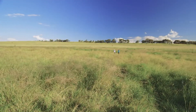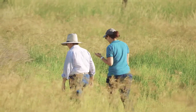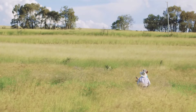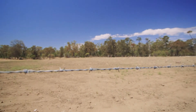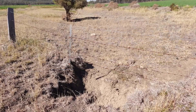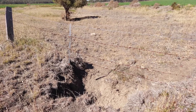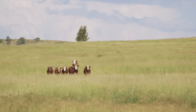This project is unique because it was really well done by Robyn using the battering technique. Robyn spent a lot of time monitoring the site — even after a rainfall event, when there were early signs of wash starting to happen, she went back in and repaired those areas. She followed the principles to the letter and put a lot of effort into the rehabilitation after the earthworks were done, which gave it really good ground cover and meant it's been really successful. One of the other important aspects of this technique is fencing the area and moving any fences that are in the way to get the right ratio, then fencing it to keep stock out and allow ground cover to establish before managing it differently to the rest of your paddocks.